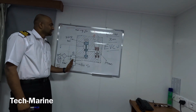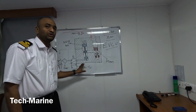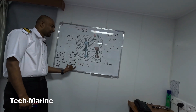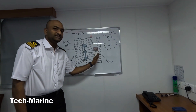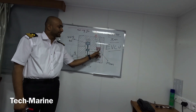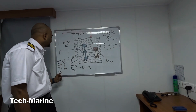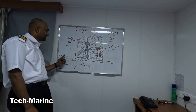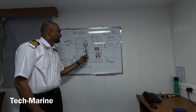To summarize: the EVCU is connected to the servo oil rail unit, which I explained earlier. The EVCU contains one rail valve, one sliding rod, and one piston. The piston has one hole at the center connected to the bottom of the piston. When the rail valve activates, the servo oil at 200 bar pressure passes through this rail valve through the filter, then goes to the sliding rod, pushing it up.